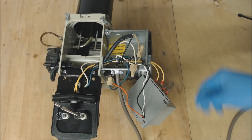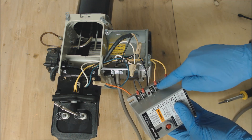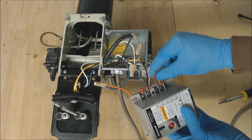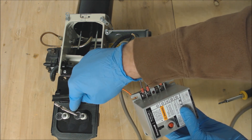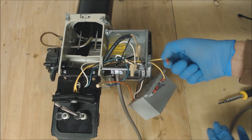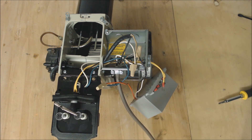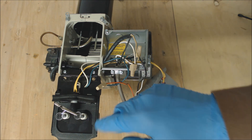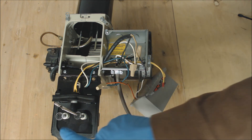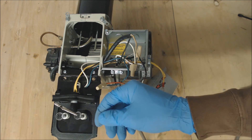Now I'm going to go ahead and turn the power on. You want to make sure that your CAD cell wire is disconnected — on your oil primary control it wants to read a very high resistance value, basically as if it's disconnected, in order to start. Make sure that none of these are touching anything when we turn this on, and make sure that we have our reset pressed in. That's a rather wide spark gap — further than 5/32 of an inch or an eighth of an inch. I'm going to go ahead and turn it off now. You don't want to have that running too long because you don't want to wear out the spring or your alligator clip. So you just want to test your gap — you can see that the transformer itself is strong enough.